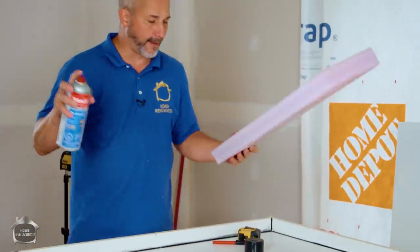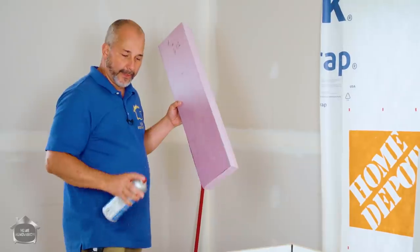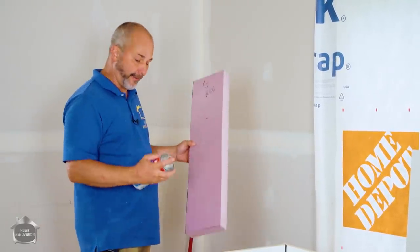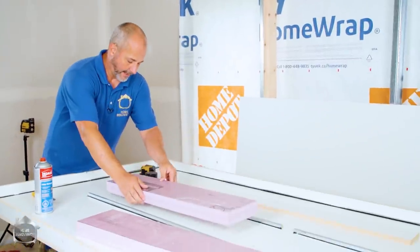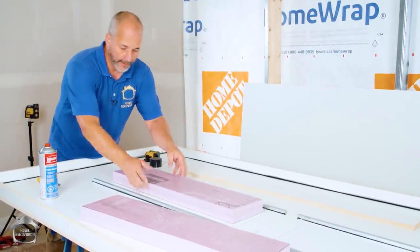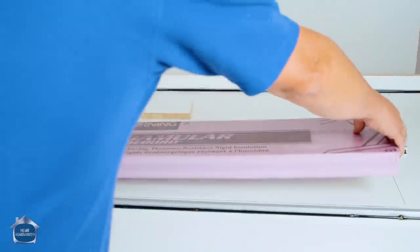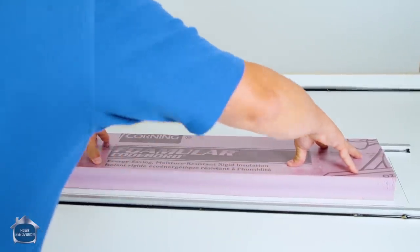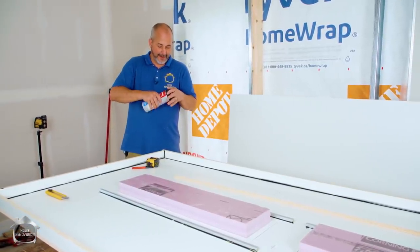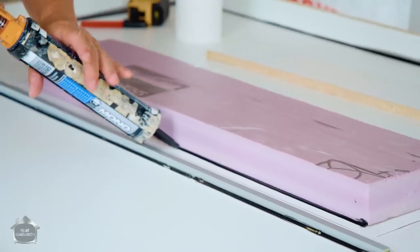Okay. There we go. Two inserts. And again, it doesn't matter if they're perfect. Now, this particular adhesive I'm going to spray off to the side here. I'm just going to get at both ends just a little bit, and then we're going to use another bead of silicone to hold everything in place so nothing gets underneath. It's like silly string. Here we go. And roughly the difference in the gap should be about the same. Done. Piece of cake, eh? And roughly about there. And done. Gotta love a good heavy duty spray adhesive. Great invention. Man, you can get real creative when you know how to use stuff like this. And of course, this bead here, we're just going to goop it in.